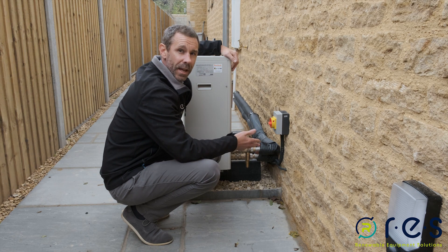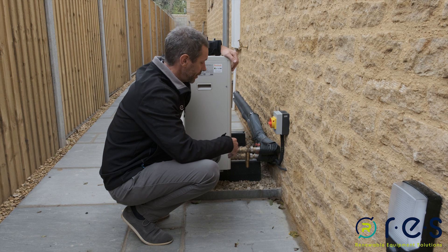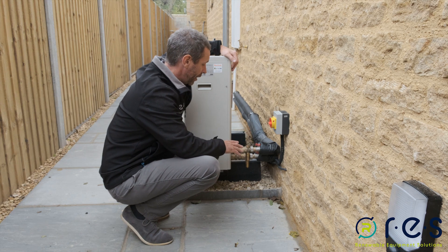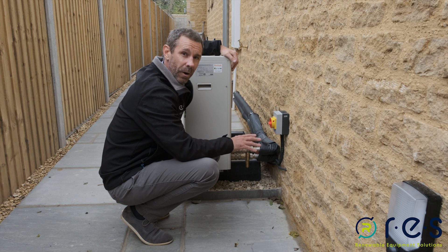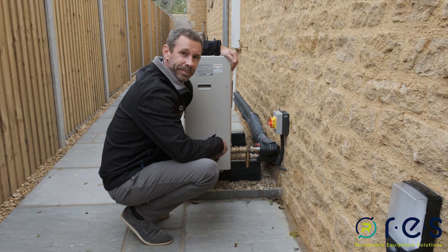If you need to change a radiator, deal with any leaks, or carry out future servicing that requires a drain down, you don't have to reclaim the glycol and put it back in to maintain the same levels of frost protection. So there are lots of advantages. It's just a simple mechanical valve — failsafe, fit and forget. You don't need to think about replacing glycol in five to seven years' time. It's done and dusted and a great option.